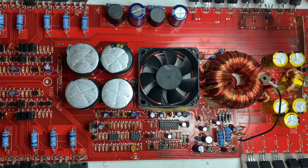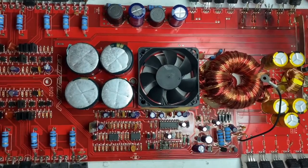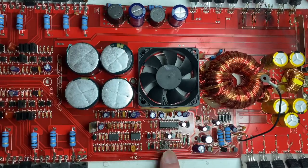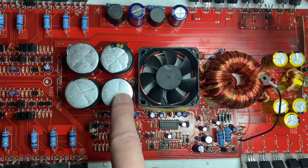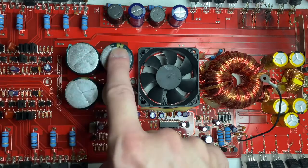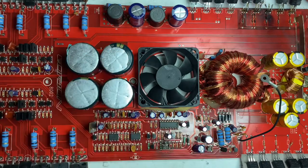So let's go over this circuit board here. What can you see that's bad? Visually looking at this, you can see that these components here are visually broken. You can see that there's a burnt mark on this circuit board right here. You also see the components over there are broken, burnt, and had caught on fire. From a different view, you would see that these two capacitors are peaked up in the center, and that means that's an indication that they're actually bad.